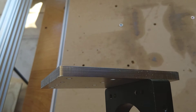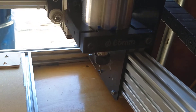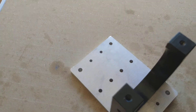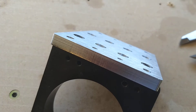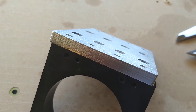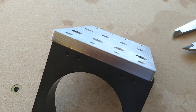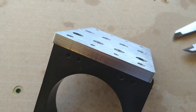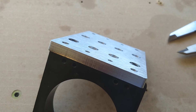What was happening was I went with my one-flute carbide end mill — you probably can't even see that guy right there — and the screws were done with multiple finish passes, while the end bits were done with full depth passes, which just kept stalling the machine. I think I could have solved that with a higher speed and a four-flute end mill — quadrupling the speed the machine was going would have been a great idea, because those chips were fine, the machine just was taking its sweet time.